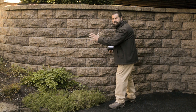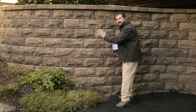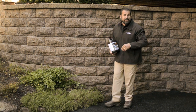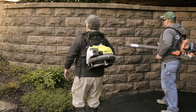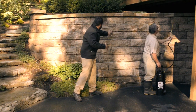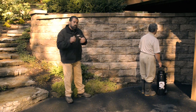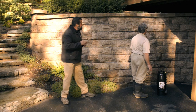Once our wall has been cleaned, now it's time to seal. But there's a lot of water trapped in the pores of this block, so we're going to accelerate that drying time using blowers. We're using a water-based or water-penetrating sealer, so there can be some moisture in the wall — we just don't want it wet. As you can see, there's still some moisture in our wall. There's no dripping, no ponding or pooling of water, just a little bit of moisture here and there. Not a big deal with a water-penetrating sealer. So using a pump sprayer, we're going to apply it. The only areas we're concerned with are the top of the cap — we might back roll that just so there's no ponded or pooled sealer in those areas. But everything's coming together really well.